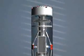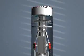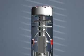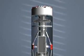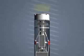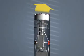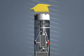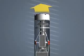Here we see the view from above. The hydraulic mechanism releases the gripper for it to move forward, then it is tensioned again for further boring. The TBM can drive up to 40 meters per day. Hydraulic cylinders control the horizontal and vertical position of the cutting head, making it possible for the TBM driver to steer the direction at all times.